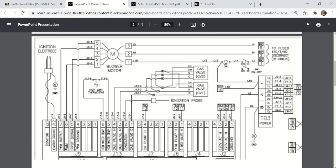And here we've got an input signal and a ground. So the blower motor gets a signal from the control board to speed up or slow down. It gets a feedback signal from the blower to the control board so that it knows for sure that it actually did achieve the right speed, and it knows that the blower is going the right speed. Over here, your terminals 1, 2, 3. Here's your L, N, and G, 120 volt, neutral, and ground.